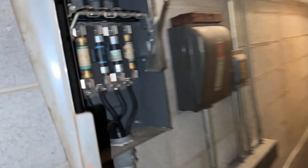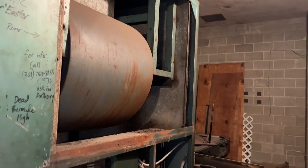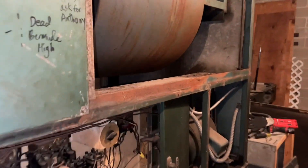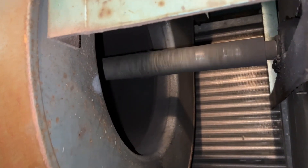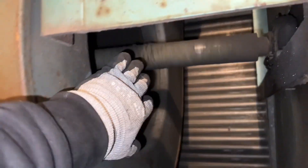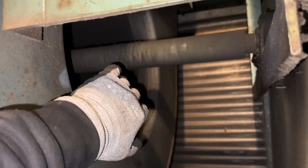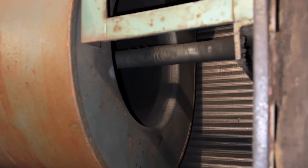This is a four-wire motor, so if I just momentarily hit power on this thing, you can see right away that it's spinning the opposite way. If it's spinning the opposite way you get lack of airflow, and even right in the center there should be a lot of air being rushed in, but there's next to nothing — so this thing is spinning the opposite way.